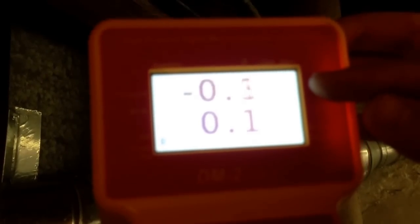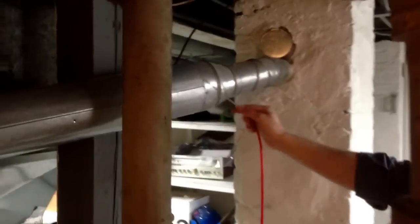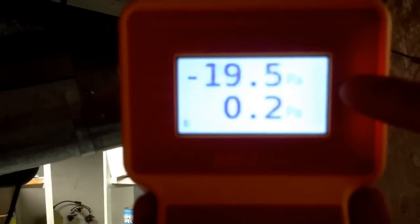The top number is what we're concerned about. Now we move it up the flue, and we can see that it turns from a nice big fat flue into a little flue. What this does is essentially choke the combustion gases off. And once we get inside that section of the pipe, we've got a negative 18 or 19 draft pressure.